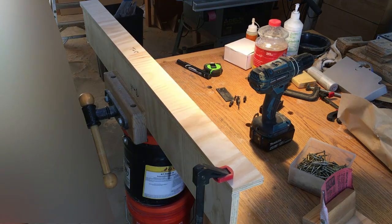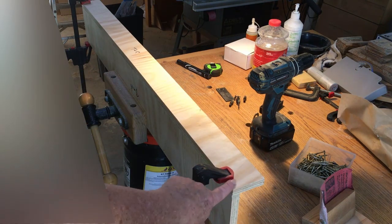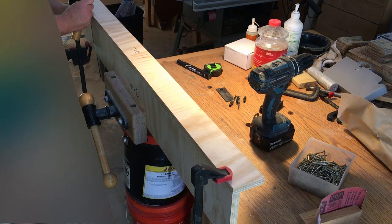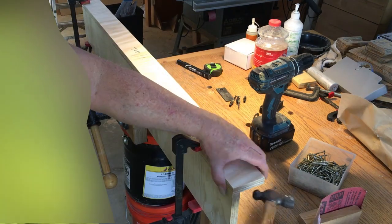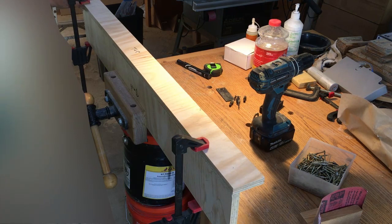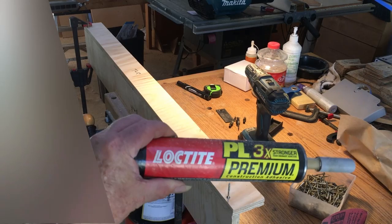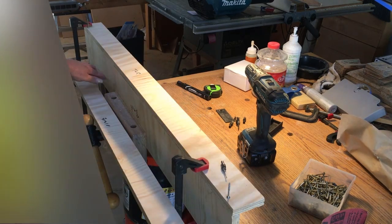Now it is time to build the back. The back is essentially a Z-shaped section and serves to form the back and top surface of the counter. It will be screwed to the base and the sides to make it easier to break the counter out of the form. First I am positioning the top — slightly clamped at both ends, I use a board and small hammer, tapping it until it is flush with the back. Once satisfied that everything is flush on both ends, I use my countersink drill to put two screws in, one on each end, then ensure the center of the joint is flush and install one screw in the middle. Now the board will be straight all the way across and I drill and install two more screws. With all the pilot holes in place, I take it apart, apply construction adhesive, and screw it back together. I will repeat this procedure for the brace on the opposite side — the brace is there to strengthen the back and make sure it stays straight.